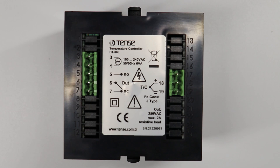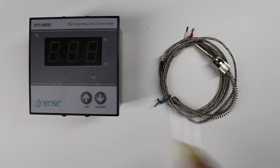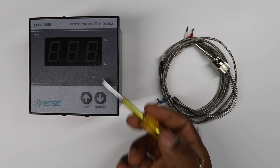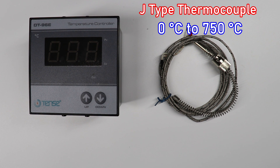When you look at the backside of this temperature controller, as you can see here, total 7 terminals are given here. By using these, we do the wiring. To this controller, we have to tell what is the temperature at the surface where we want to control temperature. For this, we have to use a sensor — you can call this sensor a thermocouple. This thermocouple changes its resistance according to temperature, and whatever resistance is there, this controller will detect it and tell us the temperature. With this controller, you have to use only J-type thermocouple. We can use J-type thermocouple from 0 degree Celsius to 750 degree Celsius.